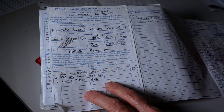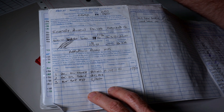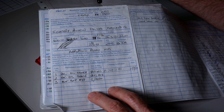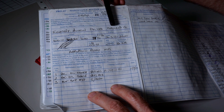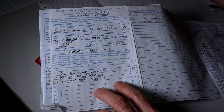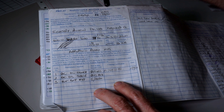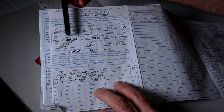We'll start off with our RA-Aus style maintenance form. This one is from the CAA in New Zealand — it's a generic maintenance release form for our Eurofox and our RA-Aus fleet. This is a Eurofox 3K; 55 is the number of maintenance releases that have been issued off that pad. The registration is 24-5350. It was issued by Flights Go Aviation Proprietary Limited at Boyland or Archerfield where the maintenance was done, at 1,676 hours, with the date and time it was issued. It's 100 hours on from 1,676, so it expires at 1,776.